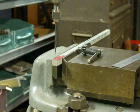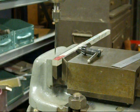Now I failed to mention in the previous segment: be sure and do not turn your machine on when you have the indicator in there. That is strictly a static setup that we're doing — never under power.